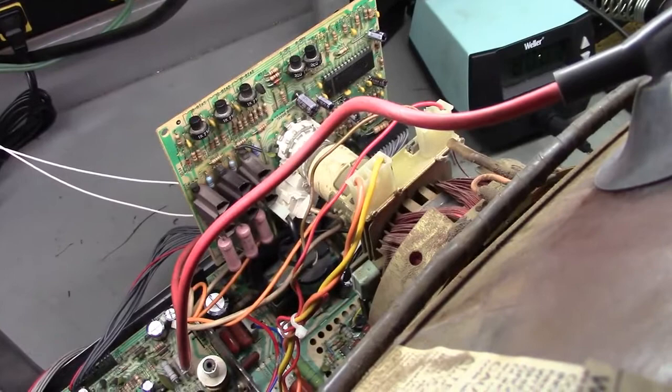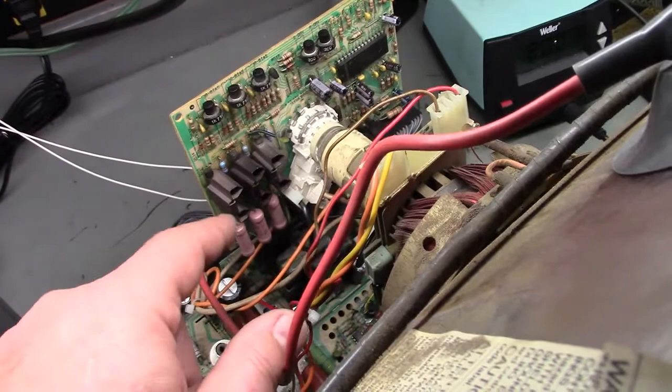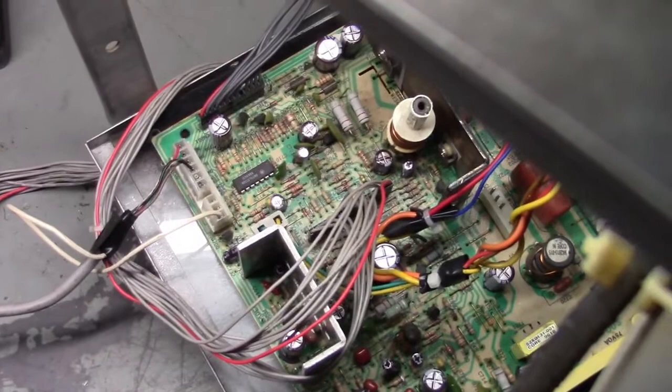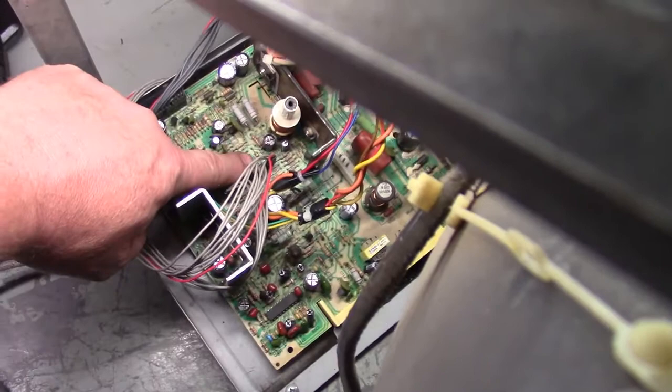Now, if you're missing one color or the other, that's always obviously going to be the notorious problems with the transistors or the traces or the resistors in between the heat sinks that heat up and break and open up, or these resistors here, or these transistors over here. These three transistors here, the little NPN, PNP transistors, those are for red, green, blue. Those can go open. You can have bad header pin solder, you could have a bad wire, you could have a bad main PCB. Missing one or two colors could be any number of a dozen different issues. But if you have no colors and contrast does nothing, then it's either going to be the R811 or that chip.